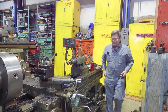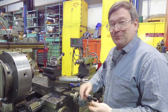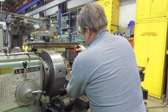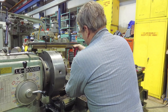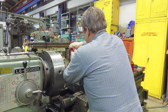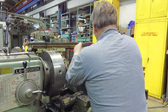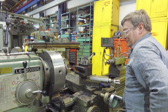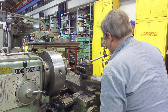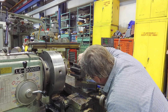Now why am I not using inserted tools like I normally would? Well, they're kind of a cheat — they will have chip breakers built into them. I just wanted to start with the most basic possible. I didn't want to go wasting new tools and I didn't feel like grinding that one again, but we are at least grabbing another good used tool. And actually the insert tools are actually cheaper most of the time for me because I buy them surplus. So let's see if we get a little bit more of that cut going again.